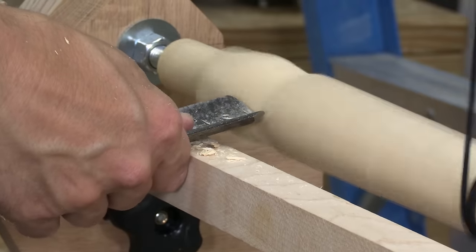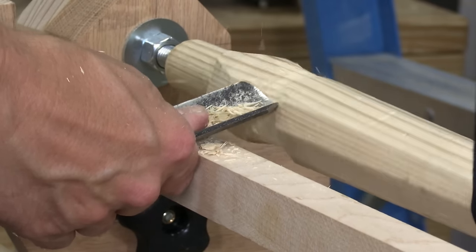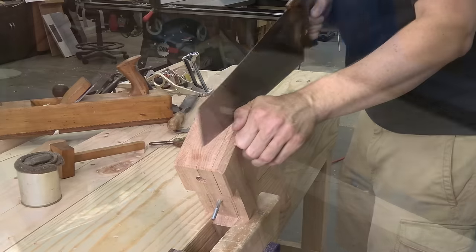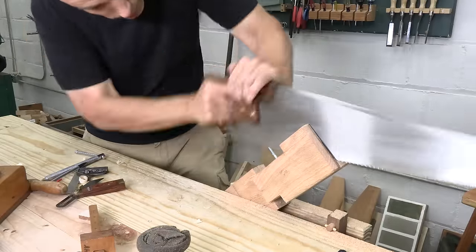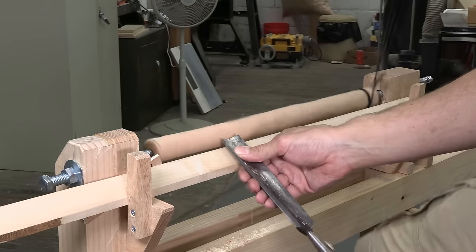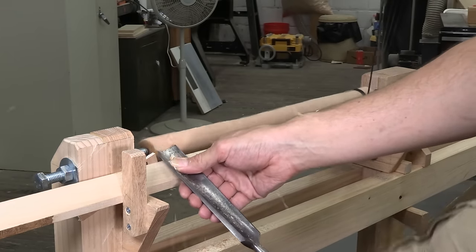My tool rest shouldn't be square, and I fixed that a little later, but my tool is also too high and too far away from the work. As I tested it, I figured out that both my poppets are too wide, and they push my tool rest too far away. Unfortunately, this called for significant modification. I ended up sawing big pieces off the movable poppet and the fixed poppet, and if it looks like these cuts sucked, they did — they totally sucked. I ended up doing a significant redesign to both these parts, and then the lathe worked well. It's still a little jumpy because I've got too much tension from the pole, but it's cutting way more smoothly, and I can feel that the tool is at the correct height and distance from the work. It's been a long project, but I finally got it.